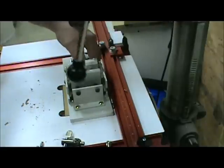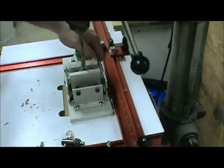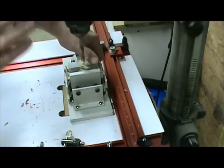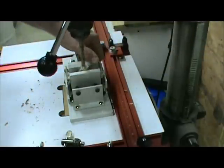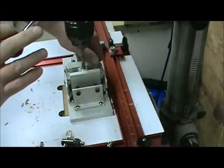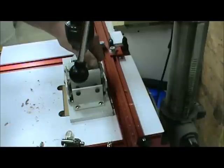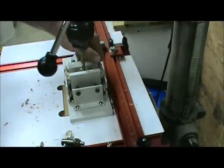So I kind of ease up on the vise a little bit right when it goes into the hole, that way it will center itself. And then I hold it firm and chase the hole. If you're trying to use a brad point bit, it will not center itself. It'll just tear the top of the bit, the blank part. Leaving the chips out of it so they don't get bound up in there and tear up the blank.